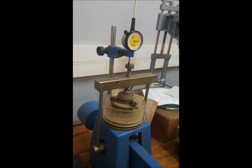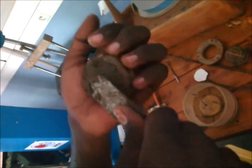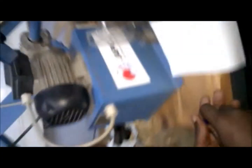The dial gauge is the main tool, as its displacement helps in getting the vertical strain. Soil is trimmed in the ring to get the same height, and then you wait and record its initial weight before consolidation.